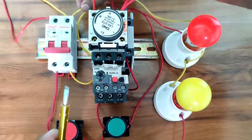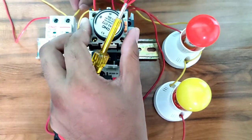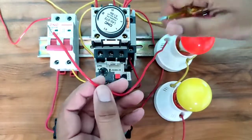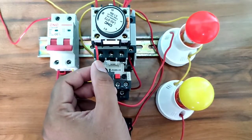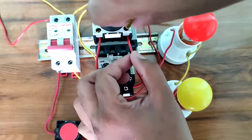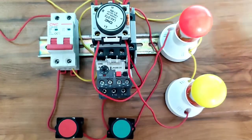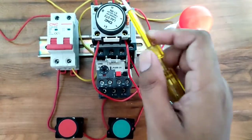For load connection, first provide neutral power supply — connect neutral from the MCB. For phase control wiring, the red light (connected to the timer NC point) gets its phase from terminal 55. When the motor starter starts, for the first 5 seconds the red light will be on. After 5 seconds, the NC opens and supply comes to the yellow light through the NO point. Since our load rating is below 10 amperes, we connect directly to the timer terminals.